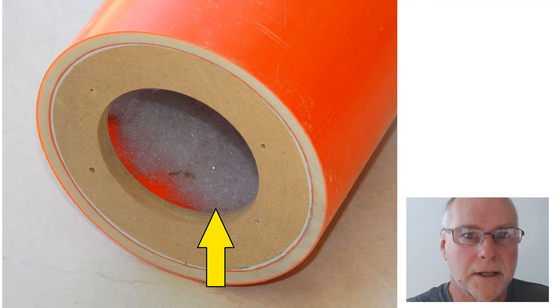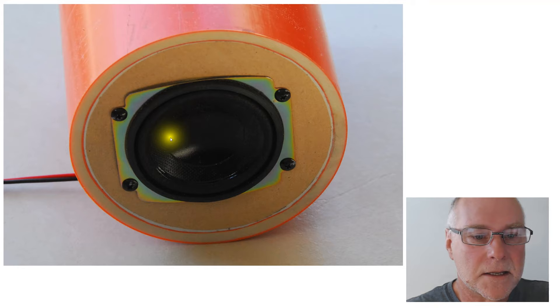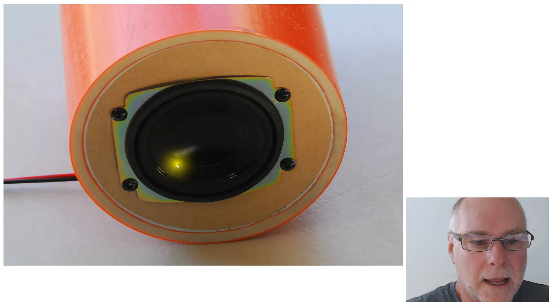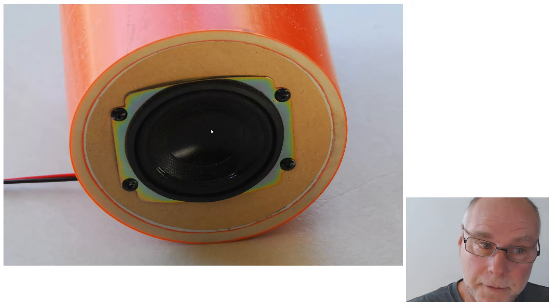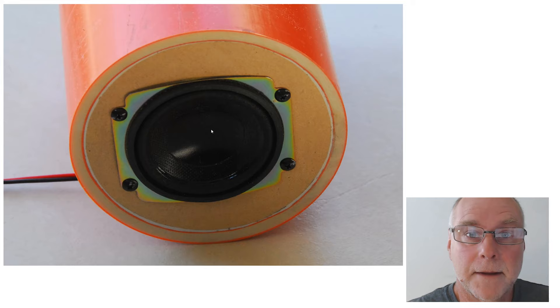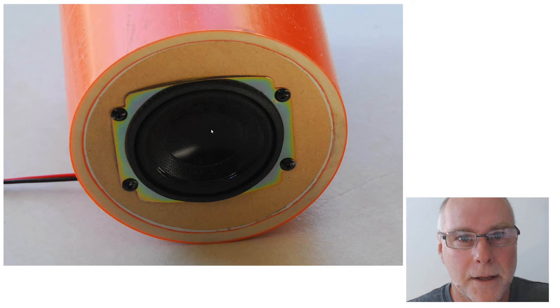Just leave room for a wire to come out or a terminal block, whichever you want. This is a different driver — I've made a couple of these sets of pipe speakers, and this one's a slightly smaller diameter speaker. Obviously, it has to be able to fit in the pipe. This pipe is available in sizes up to about 300 millimeters diameter and perhaps even larger, over a foot in diameter. So even if you've got an 8-inch speaker, you'll certainly be able to find a pipe to suit. Don't go really long in the pipe because then you'll get reverberations running up and down the pipe, and that's likely to adversely affect your sound.